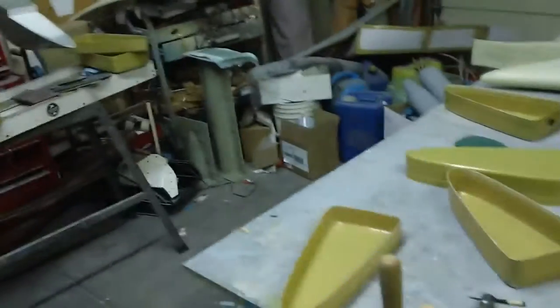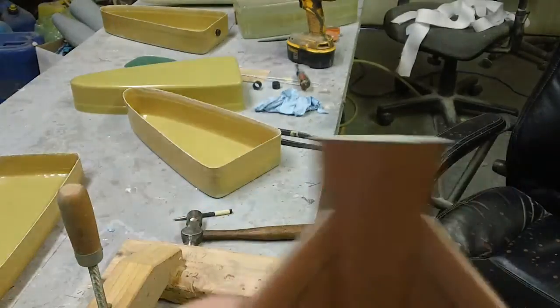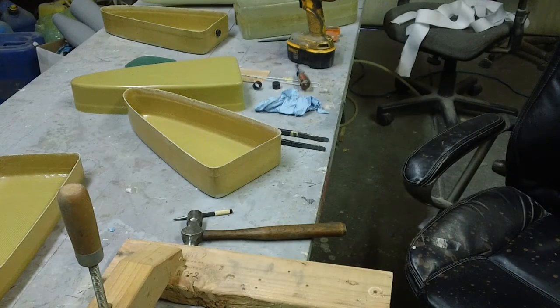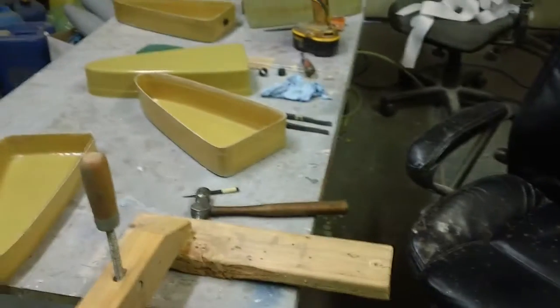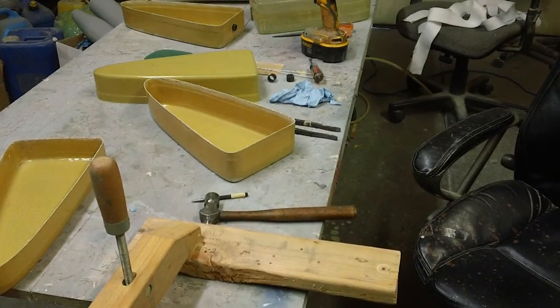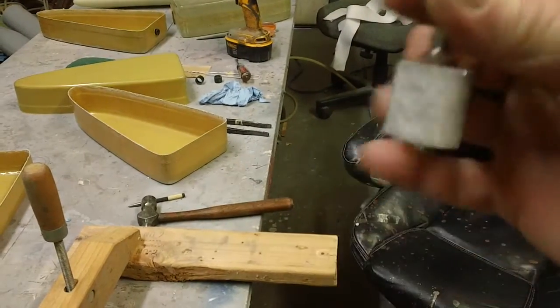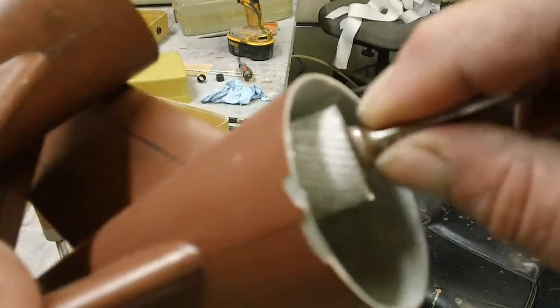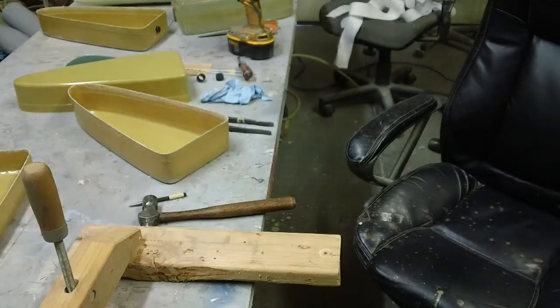I actually got them fins cut off. The old heavy blasters — them things were heavy. Got them all cleaned up, they look brand new. I use my rotary file. I can put this on my drill or chuck it up in my dotco. Harbor Freight, these things are about 15 bucks. This is what I cut the grooves in the aluminum spar with — this thing chews up aluminum and spits it out. It worked really good in here, just grinding it out. Now it's just smooth, looks brand new. So they're ready to glue on the blast tubes.